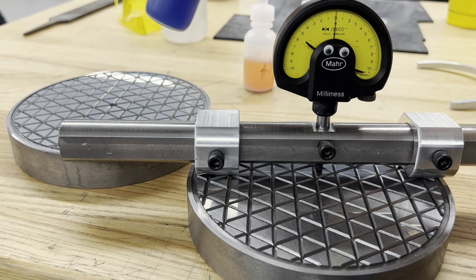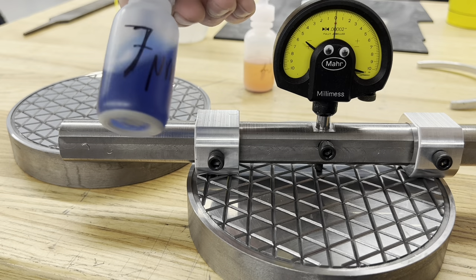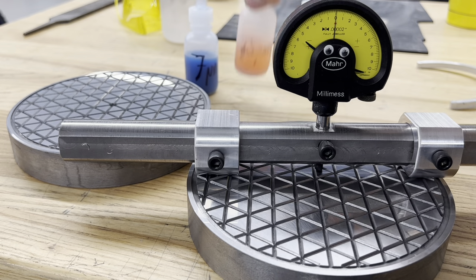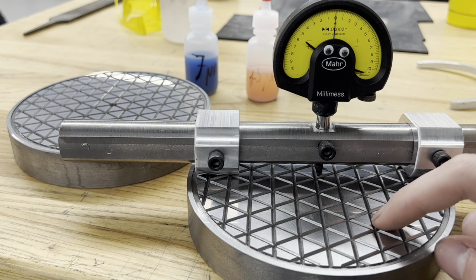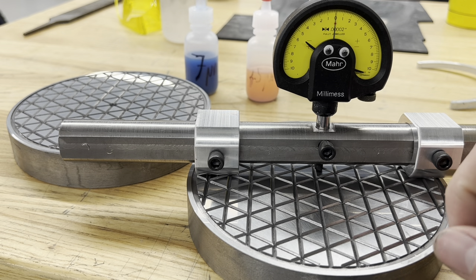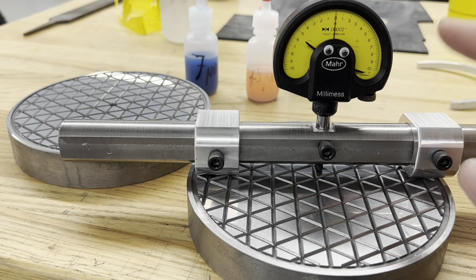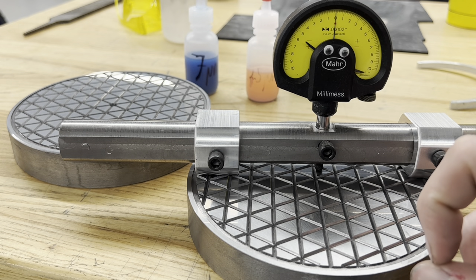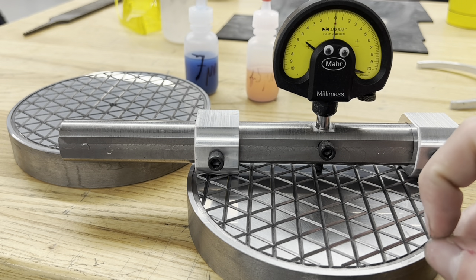So we made up a couple of slurries of diamond paste. Here's a seven micron — the diamonds are all settled at the bottom, but you give them a shake and get them resuspended. We got two and a half micron, and then the five micron is what I used to do the plates. They held a charge decently well, but they're not super embedded, to the point where the test part I'll show in a minute was actually done with two and a half, even though the plates were roughed in with five. And it's noticeably better — so that was definitely a lot of rolling, tumbling abrasion action going on.